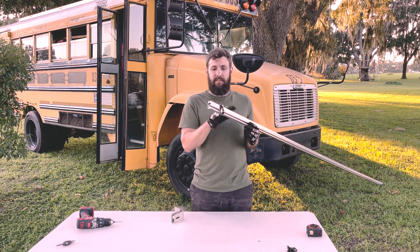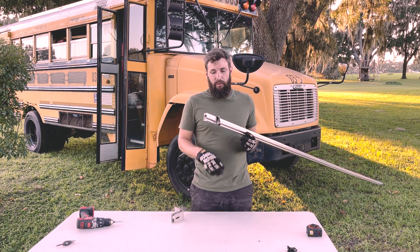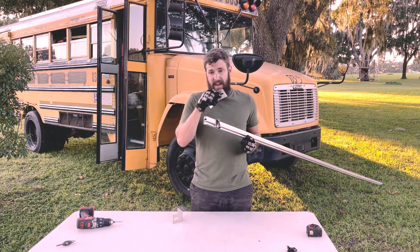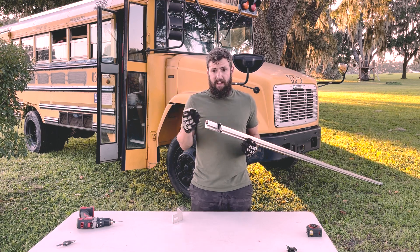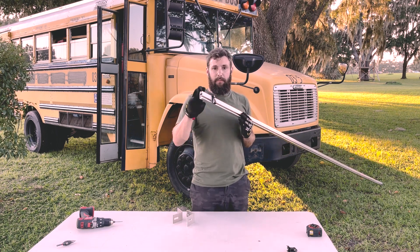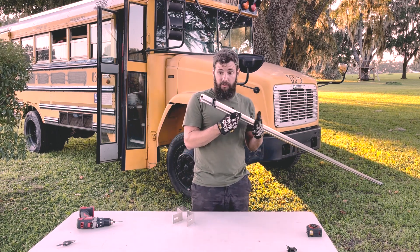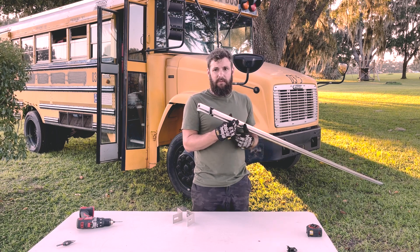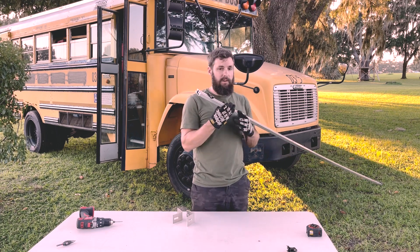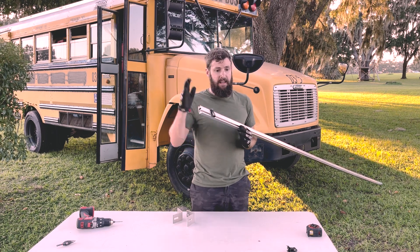There are a handful of brands out there — IronRidge is one of the really common names. I'm not a purist about any of it; it's all aluminum with stainless hardware. This skinnier rail I use on flatter buses, and it's rated for 150 mile-per-hour winds when mounted to a residential roof with beefier brackets lagged into wood. I've never had any issues or had panels come off, especially since we're using the adhesive caulking anyway. You'll need to go to a local solar distributor and have a vehicle that can carry 14 or 17-foot rails. They're not expensive compared to making a unistrut system — I highly recommend it. The system is bulletproof.